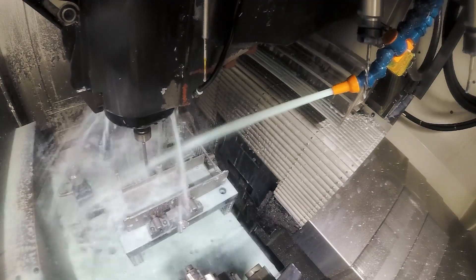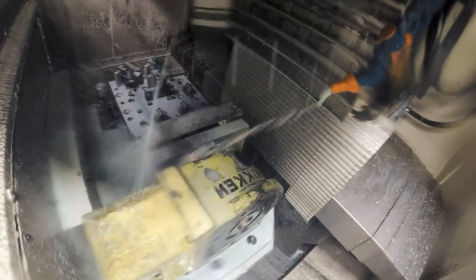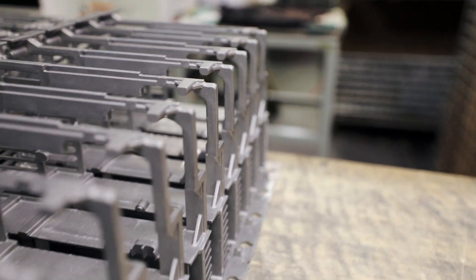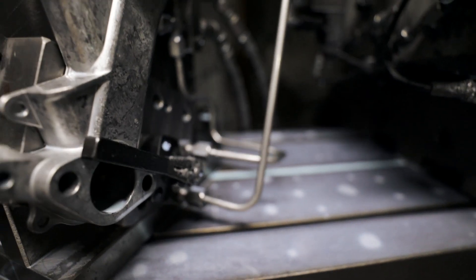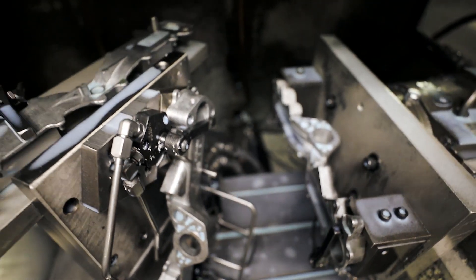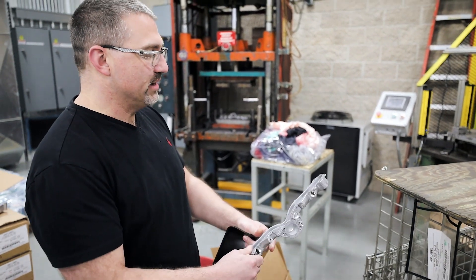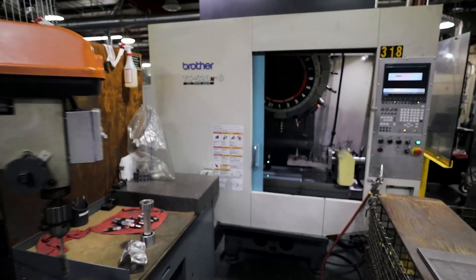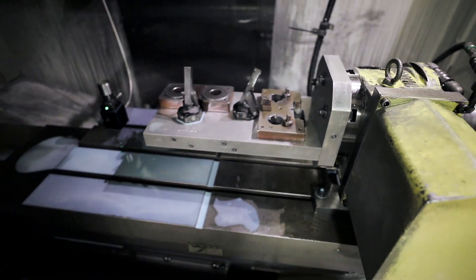Since the implementation of the Brother Machines we have saved a lot of time because of their quick rapids and quick tool changes. You can position all axes at the same time as a tool change, so the part is just ready to go when the next tool comes in. Because of the ease of the machine we have also decreased setup time. We do a lot of drilling and tapping bolt circles and other features that require real tight true position callouts, and the Brother has no problem keeping up with what is required.